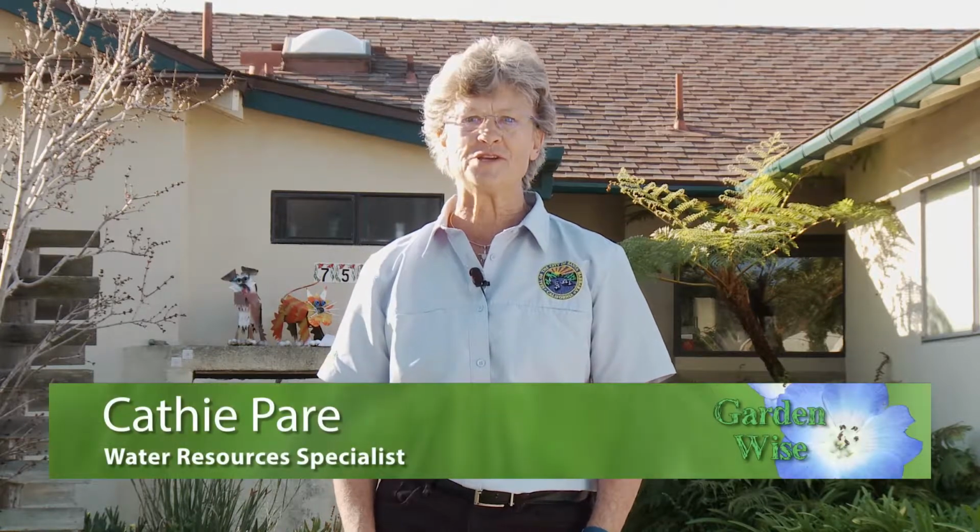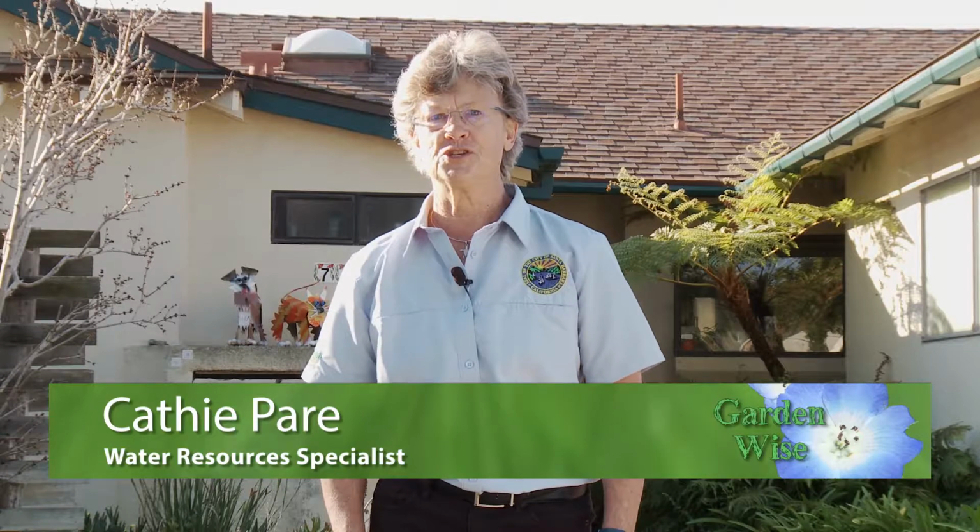Hi, I'm Kathy Perret with the City of Santa Barbara's Water Conservation Program. Today, we're going to talk pressure in your irrigation system. Pressure is the Goldilocks of your irrigation system. Too much pressure, and you're going to see misting. The water's going to blow off site, and it's totally inefficient. Too little pressure, your sprinklers don't pop up.